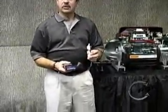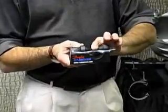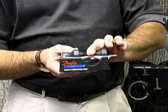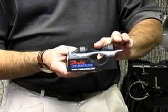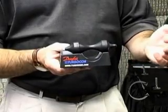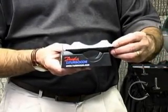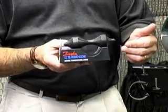This represents the shaft of the TurboCore, and this represents the body of the compressor. As the TurboCore is sitting in the off state, a command is given to the compressor to turn on. The magnetic bearings are energized, and the shaft is levitated in the magnetic field and is free-floating. Once it's free-floating, the VFD is given a command to start, and the shaft is brought up to speed to compensate for the amount of cooling that's required.